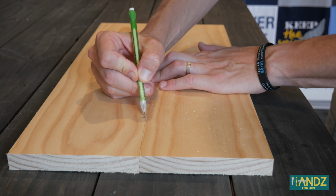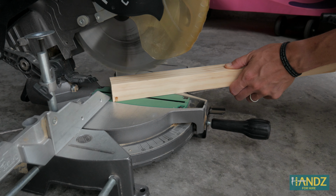And now this is representative of the shelf sitting here with the computer on it. So I'm angling it so that the bottom of this, where it's gonna attach to the shelf, is right at 11. And then it's gonna shift in probably about an inch once I make the cut down here. So I have a second level here. And I'm just, as I hold it in that one spot, I'm leveling it down here. Will we level up there, Lila? Mm-hmm. I'm making the line, and that'll give me the angle, the cut I need to attach it to the wall.